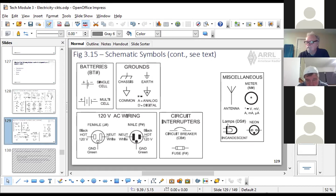We're getting rid of most of the incandescent lamps. And I don't think I see very many neon lamps. Although if you break open the fluorescent light starter canister, they usually have a neon lamp in there. It's filled with neon gas, and it glows at voltages above 90.